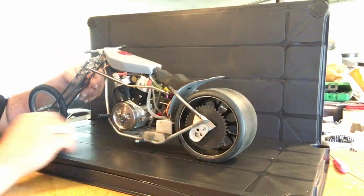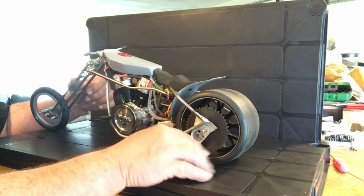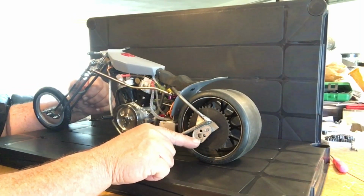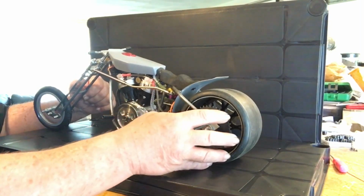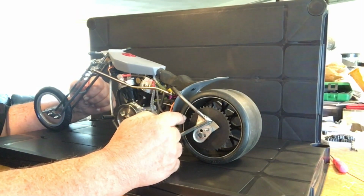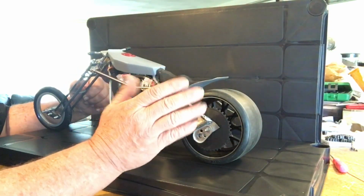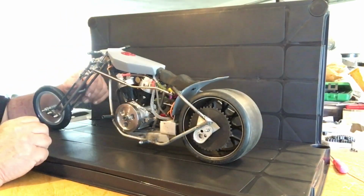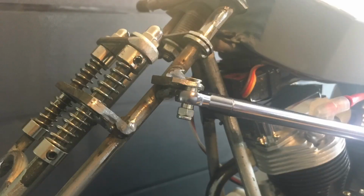Now you see I got this big huge sprocket here. Things you run into is I didn't realize this thing would be this heavy. And you see here I had to come up with a different way to attach the back here, which I will rework. So this sprocket is super heavy, and the 17 millimeter wheel adapters I use aren't centered, so I'm gonna have to try to figure that out, because they're all brand new out of the box with the wheel even, and the wheel wobbles like this. But now I set up my steering servo back here, up here to a pivot point.